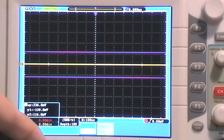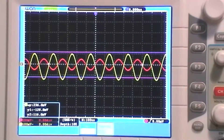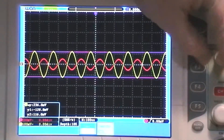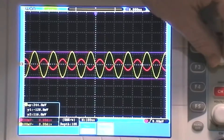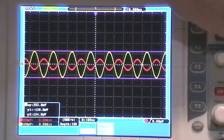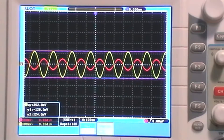Now with 390 ohm: signal in, signal out - a bit more gain. Measuring that: reading 252 millivolts, I predicted 256 millivolts. That's about right - getting out what I expect. More gain each time.